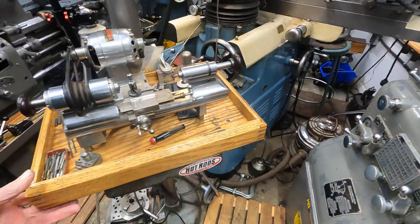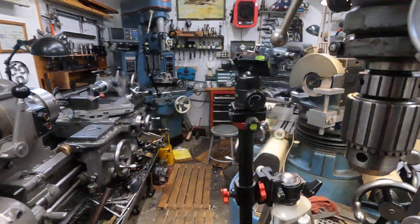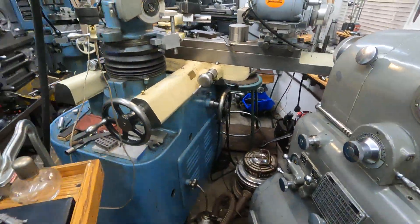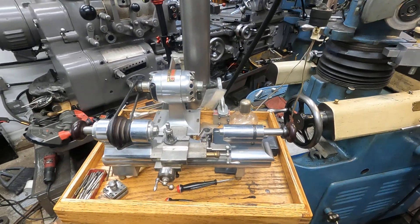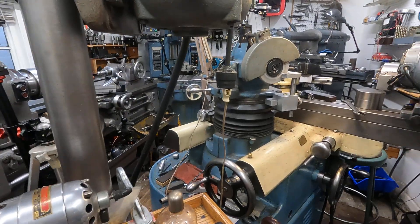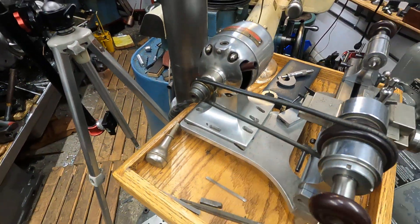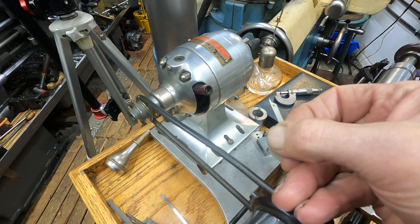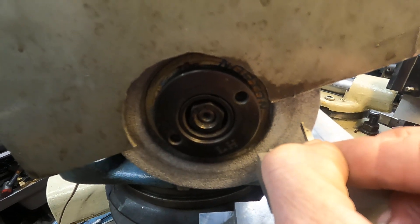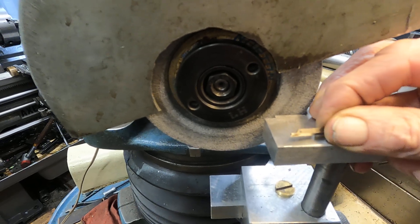I'll show it from this side. I've got my swing-around jeweler's lathe here, and I have the handles on the other side. I can swing this on over to that side — this is a nice little spot here to work the jeweler's lathe. I'll sharpen the bits here. The bits are very, very small, tiny little things — hard to hold in the machine, and they really don't need to be machine ground. It's something that's just easy does it with your fingers, and then you stone them. That's a cutoff tool there — one eighth inch. Isn't that cool?